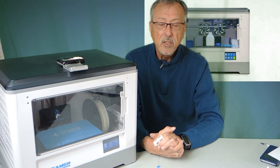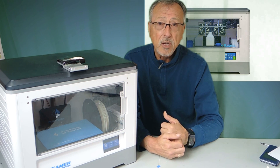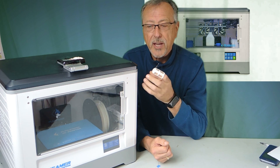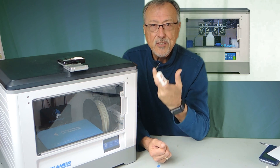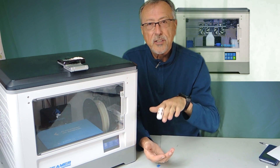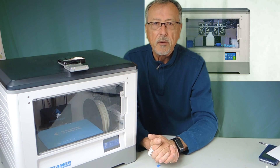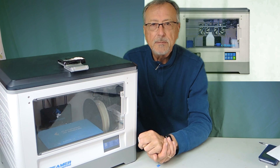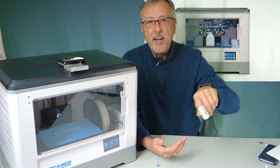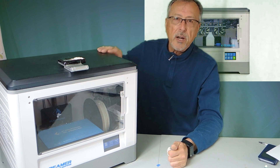I found there was a lot of confusion and misinformation, but it's actually quite easy if you follow my video. One thing I hadn't fully considered was the challenge with a single-head 3D printer — making sure your bed is level and your nozzle is the same height all the way around. Now we have that times two, because we need to make sure both nozzle heads are level, and this product does a good job.